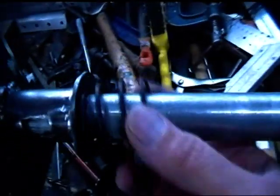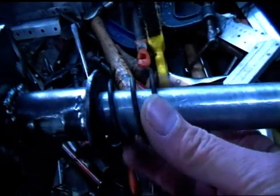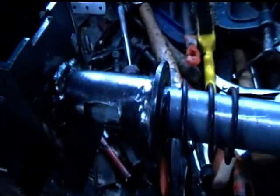So there's a lug welded onto the side of the barrel, and that passes through a hole here, and the barrel will pull out the front. I've then welded this pretty much like a large washer with a section filed out so that the lug passes through. Now, on the barrel here, to make sure it stays in, I'm going to be fitting this spring. Let's try and put this barrel back in again. Yeah, it doesn't want to at the moment.